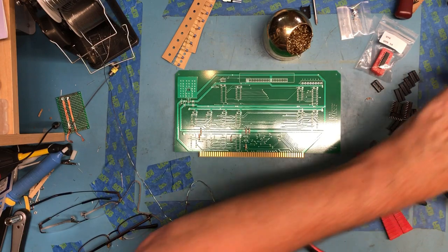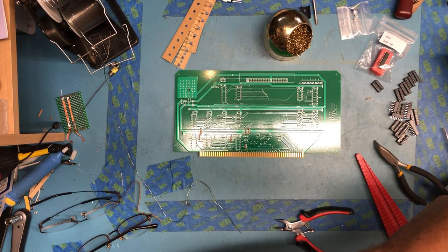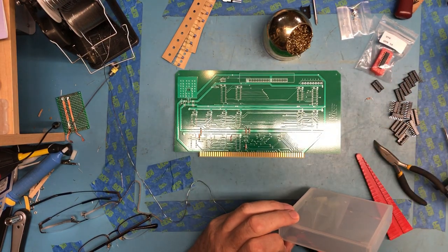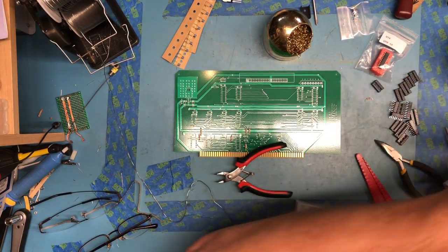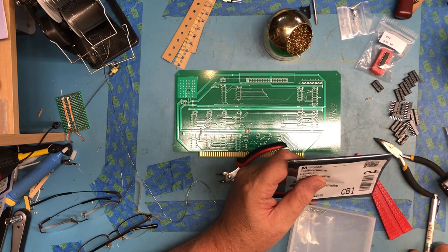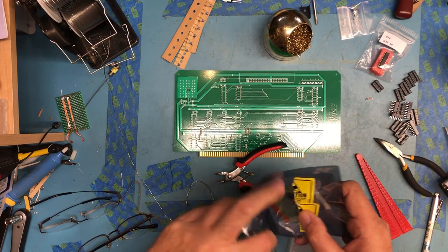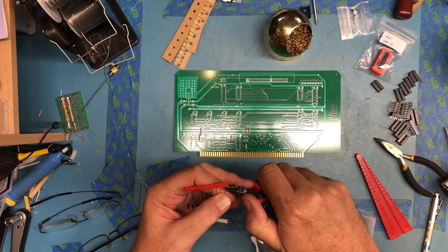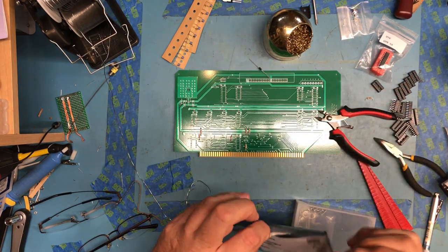We've got a diode. Let me find the little bag of the Schottky diodes. Logic, logic, logic, logic. Okay, that's nice and confusing. Here it is. So there is, check those resistors off. There's D1, a 5817. I have a little bag of them here. As instructions say, you can bypass this if you're never going to do in-circuit programming of the PIC microprocessor that implements the state machine. I'm going to go ahead and configure it so I can do that in-circuit programming, just because why not?